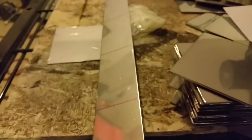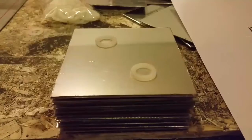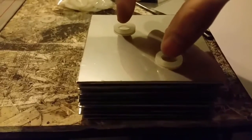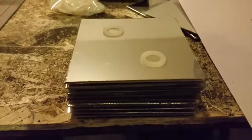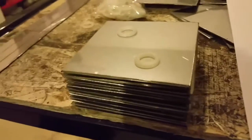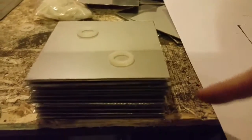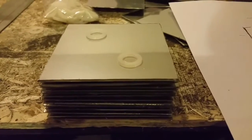I will be able to use this extra piece that I had left over from the sheet, cut this into different straps, and then I should have enough to bend it around and over. Hopefully that'll work. I have a spare piece all marked up. I'm going to cut nine different pieces for the straps that I need. I mocked up some washers to show how this will be held together. I'll be using two threaded rods through — I was just going to use one through the center, but two will stabilize the sections better. I'll be able to have a strap go from the top, out around, then down, and bolt everything together.